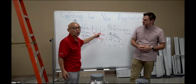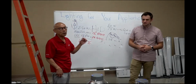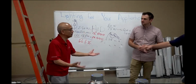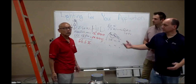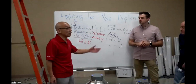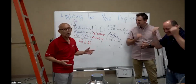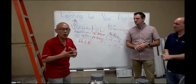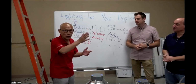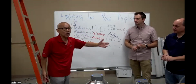So all of a sudden you look at 15,840. But remember this, Paul, we always talk about this: every time people do the retrofit, why do people say too much light? What does that mean, too much light? Well, they're used to seeing this light level, because after, let's say, 5,000 hours, a couple of years of having it installed, in other words, when we install a new one, you're happy. Your forehead is shining nice and bright. Then day by day, by nature of the metal halide, just like a regular light bulb, it depreciates slowly. Our eye will not recognize it.